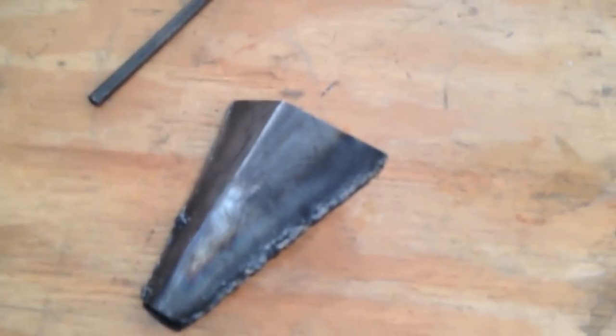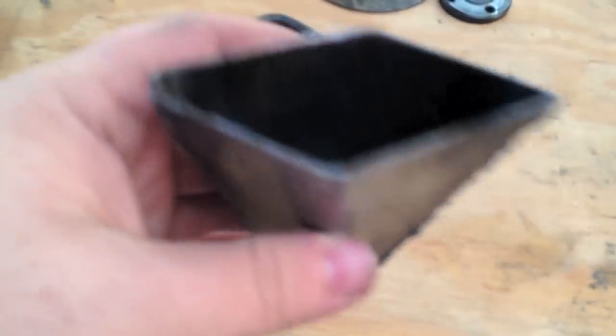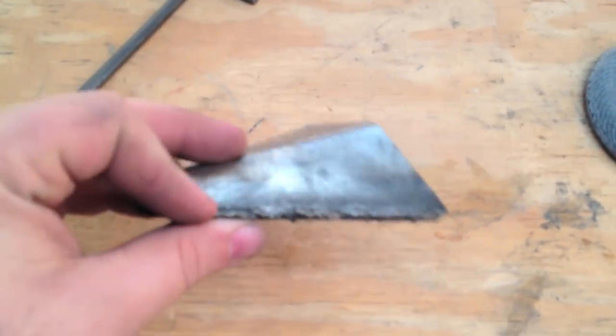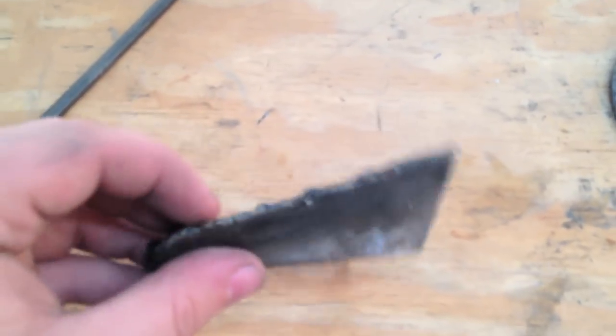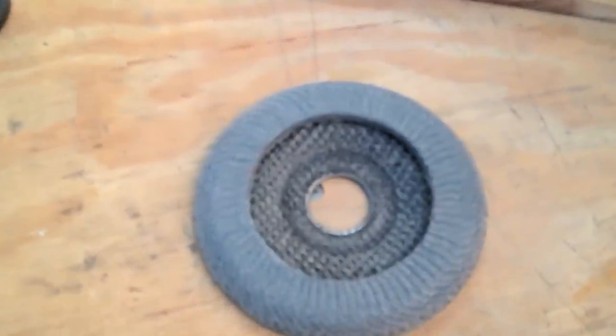So I don't claim to be the best welder out there, but this weld is insanely hard to do. The material is way too thin, and I misaligned it — so that's awesome. I had this machine set to the lowest setting and it was still burning through, so that's why I tacked it like a thousand times and then came back with a somewhat full pass. But even still they're like booger welds. You do what you can, and there's nothing a good old flap disc can't fix.